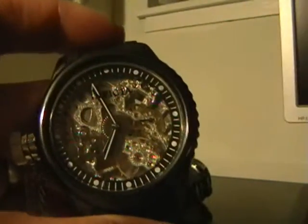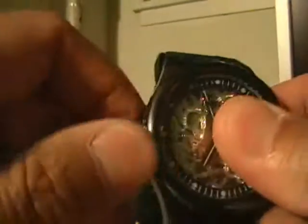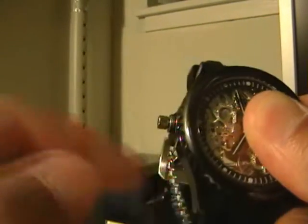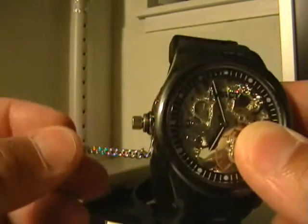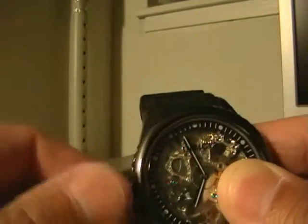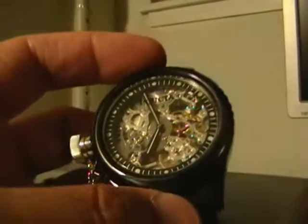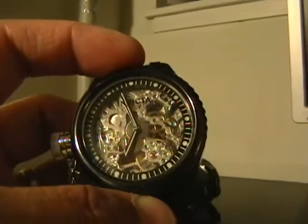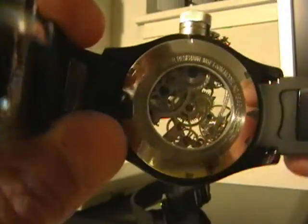The total watch and total movement have, in this particular case, I'm measuring about a 55-hour power reserve, and I can basically give the main winding crown underneath this cap here about 15 to 20 turns in the morning, and I'm good for a day and a half to 2 days worth of power reserve based on that. I have a lot of other mechanical watches, most of which are automatic winding. They have a wind rotor on it. This particular 6497, or whatever you want to call it, ST36 I should say, has such a long power reserve on that big mainspring that I quite honestly don't even miss the automatic winding. I basically twist it, like I said, every other day, and I'm good to go for a couple days.